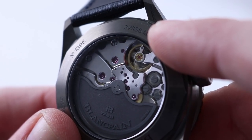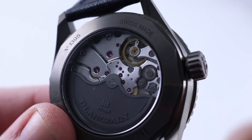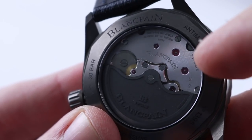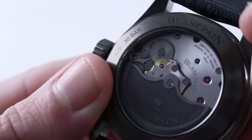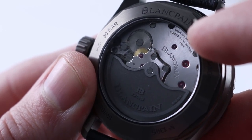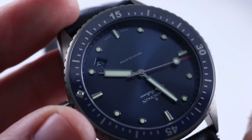Caliber 1315 with three mainspring barrels and a 120-hour, five-day power reserve. It beats at 4 Hz like a conventional watch, but remember the AP is 3 Hz, so we have a higher beat rate here. We don't have a full balance bridge, but it is a free-sprung balance for shock resistance, and there is a silicon hairspring for anti-magnetism. Three mainspring barrels, with the bridge over them beautifully decorated with spiral or straight graining that's been slightly whipped so it has a curvature at its edge. The execution of the wheels is beautiful, the screws immaculate and mirrored. So this is both a more technically advanced movement — silicon hairspring, higher beat rate, longer power reserve, and six-position adjustment. AP claims no specific adjustment of its movement.